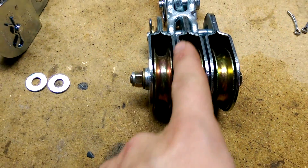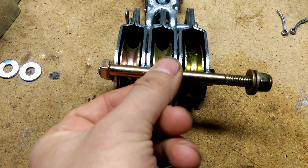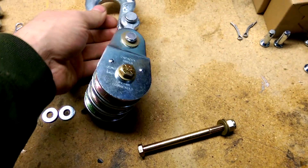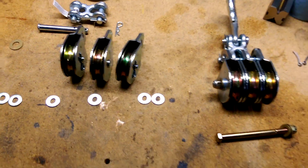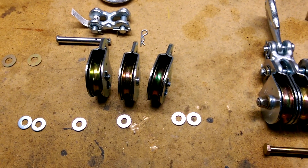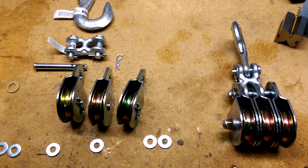You can see these little detents on the pulleys — I'm not a hundred percent sure what their purpose is, but they keep the pulleys from squeezing flush together, so adding a washer there is good. The biggest reason for the washers is that without them there's too much thread sticking out, but the next shorter bolt left threads against the pulley and the bronze bushing — so the washers solve that. I couldn't find antique block and tackles anywhere; on eBay they were wanting around 90 bucks. All in all, these parts ran me 55 dollars, plus whatever rope you use — so price-wise this is new and it's gonna work.